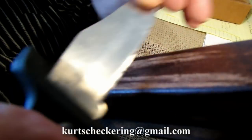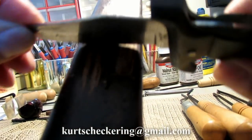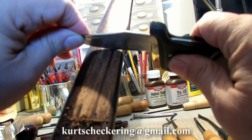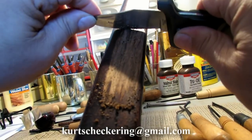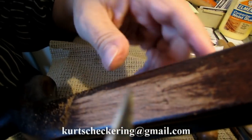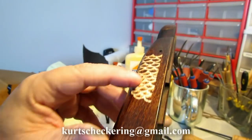Don't get too overzealous. Remember, you're just taking off the finish. Some people think it looks like you're butchering something, but you'd want a relatively sharp knife with a smooth blade — no major dents in it, no serrated blades. As you can see, we're down. The finish is basically gone, but it's still a little darker here where I've chiseled in, because the natural color of the raw wood is pretty white.